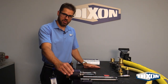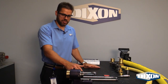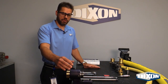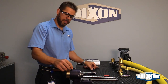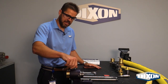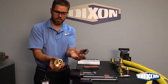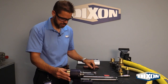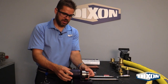This expander is a pull-through type expander. It's a manual expander. It can be mounted to a surface, as you see here, or it can be mounted into a bench vise. It comes with a few different parts and pieces. On the top of the body you have a drive screw, which locks in place the drive nut and the thrust bearing — those are the internal pieces: your thrust bearing and your drive nut. It also comes standard with a thrust connector.